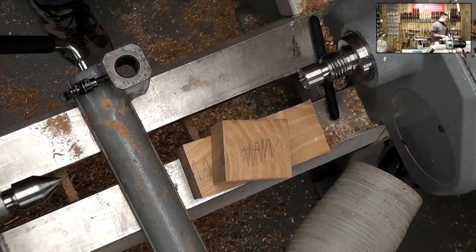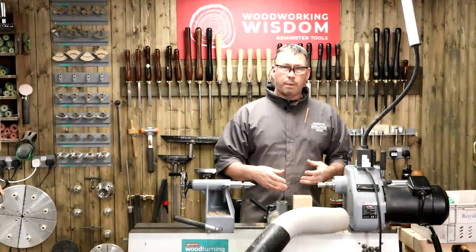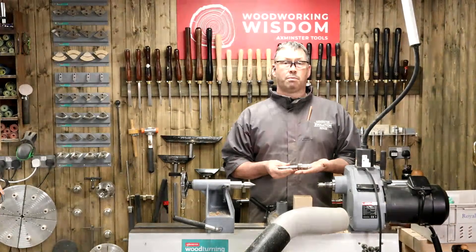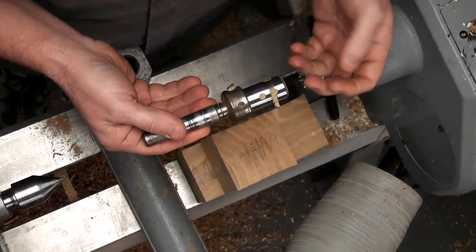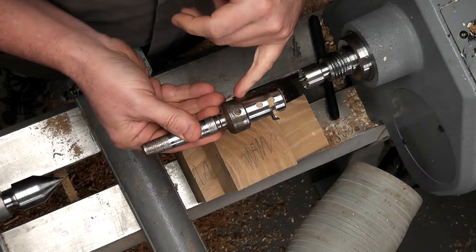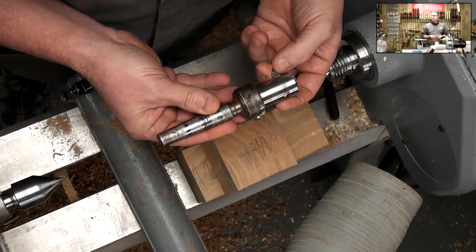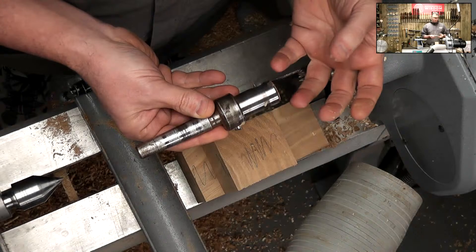There's an awful lot of drilling to do. If you're into making large numbers of salt and pepper grinders, you would have invested in either something like the mill drill, which is what I'm going to use, or a series of sawtooth forstner bits. Roughly the same amount of money for the same quality. You'll need three sawtooth bits to make these, coming to about the same as one mill drill - over £100.